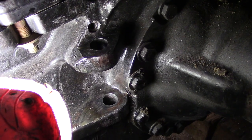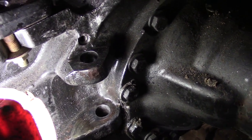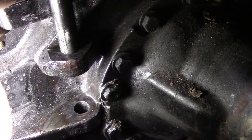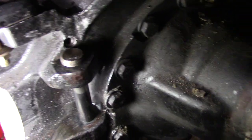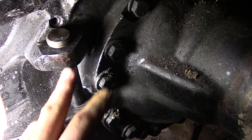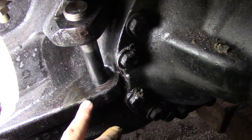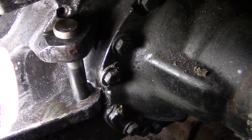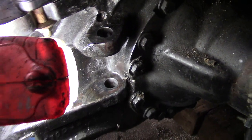I've got those holes cleaned up and essentially dry — no anti-seize or lube on them yet. This was 100% stuck because it went together dry; nobody put any anti-seize or any sort of lube on this. So make sure to anti-seize the housing, bushing, and the pin. You can't use too much — it's much better than having to do what we just did to take this tractor apart.